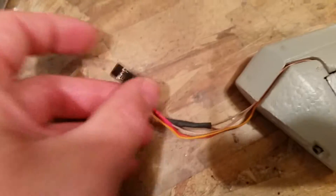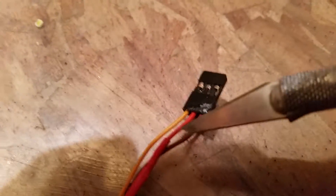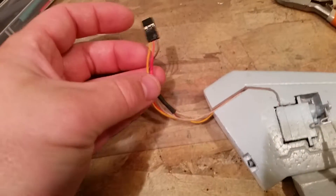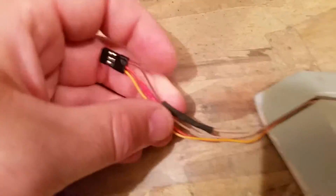It's just a servo end, so all you've got to do is take and basically lift this little tab up, and then this thing just yanks out. Just separate the leads from one another. Then you can come back here and use a pair of strippers to superficially strip the wire. Then you just kind of pull the sheath back and forth, wrap the copper around it, and throw a little solder in that joint — it becomes one thing.